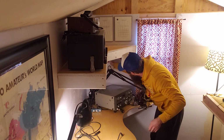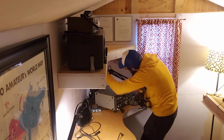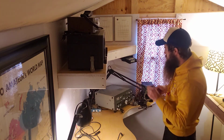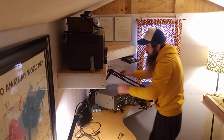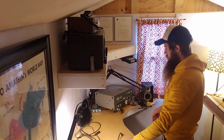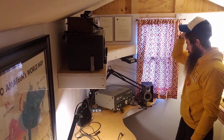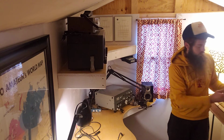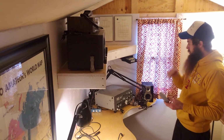Kind of a funny story on this ground wire for my 2-meter radio. I was having all kinds of noise interference, just slightly, but I obsess over that stuff, and I want to know why I have the noise and where it's coming from and how to get rid of it. And so I tried everything. I tried an impedance match, like a transformer. I built this, I bought the parts for that to try and get rid of that.